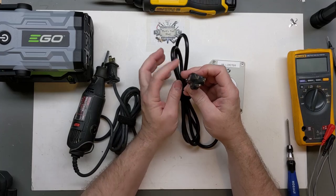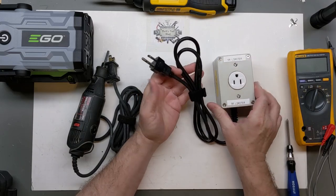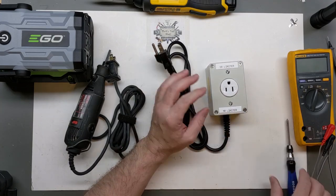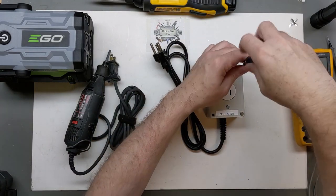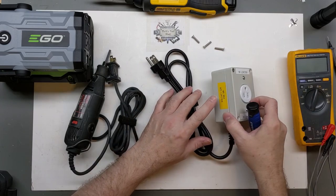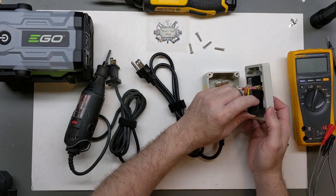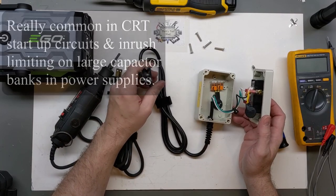I just had a two-wire cord hooked to this — I put a label on it saying 'ungrounded' so I knew not to use it as a two-wire in practice, but for demonstration purposes I definitely just hooked a ground wire to it. This is 18-gauge regular drop cord with a small single receptacle. People were asking about what type of NTC this is, so I'll show you. I used this for no more than 10-amp max anyway, so the 18-gauge is plenty enough current for what I use it for. I first used these some time ago on a 1000-watt inverter to take the edge off the startup torque of a drill or grinder.